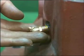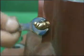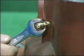Install curved neck grease hatch. Take the curved neck grease hatch and install it onto the external screw at one side of the housing. After assembling the transmission, the curved hatch is downward.